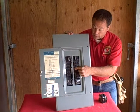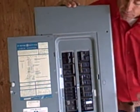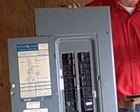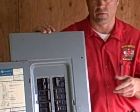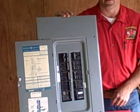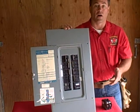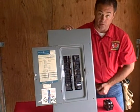This breaker here is called your sub-main for your lower section of your panel. In many homes people have added circuits throughout the life of being in their home, and that 60 amp breaker is loaded up pretty heavy. So if you decide you want to add a hot tub or some extra circuits, you're starting to run out of room — provided it was a 60 amp breaker.